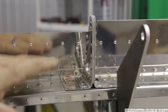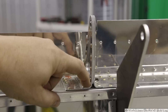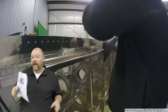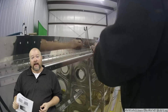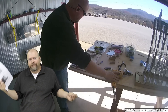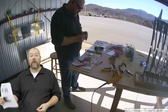So here it is assembled on the left wing. You can see this is the piece that causes issues — apparently cracking shows up by these two rivets right here and along this bend, cracking will appear. So I've got to drill this whole guy out. I'm going to continue working on this in the background. These instructions are actually well written — they assume that you're working on an airplane that's already flying and that you have discovered a crack, and they say very specifically that if you have a flying aircraft and you don't see a crack, don't implement this fix. Just put a note in the log and check it every annual.